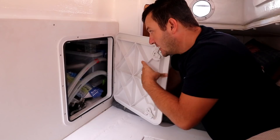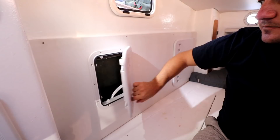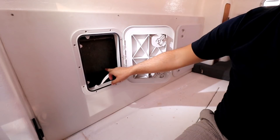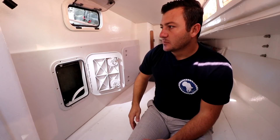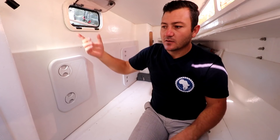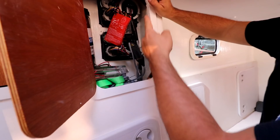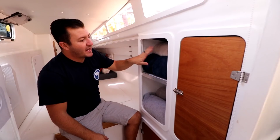Over here is where we store all our hydraulic fittings, plumbing fittings, electrical fittings, and electrical cable pieces — all of that stays in here. Then literally where our diesel tanks are installed: you can see the levels are about halfway at the moment on these tanks. We've been motoring around a lot with family visiting, doing little harbor trips, so we've used a bit of diesel. The tanks are 150 liters per side — this one is dedicated to this engine and the other to the other engine. Coming to the top little shelves are the gauges for the engines, and I store cable ties in there too.